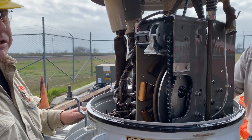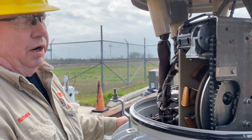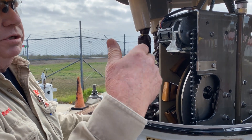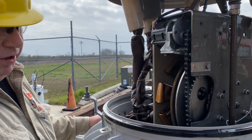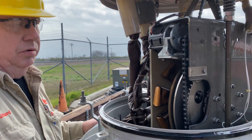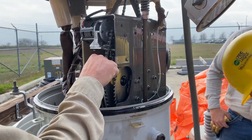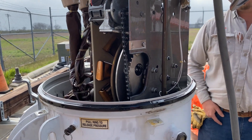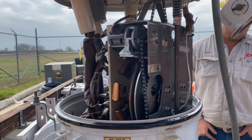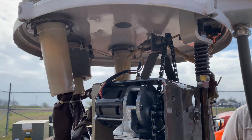When they were troubleshooting it last week, they moved the control from a known good unit to this unit — still didn't work. Then they checked the capacitor; capacitor tested good. They weren't seeing it, but they had already moved the control over, checked the capacitor, and called tech support. Tech support said that's everything we would have done.